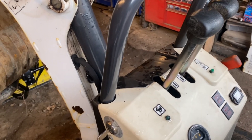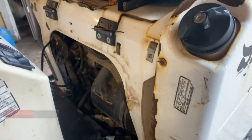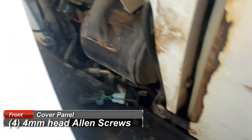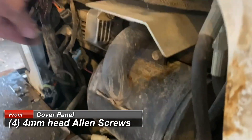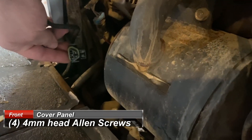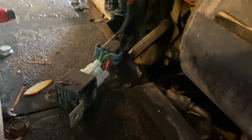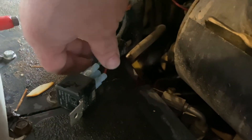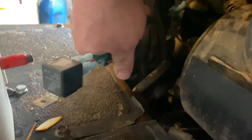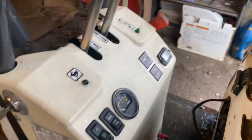The fix in this case was the two-speed module. You find the two-speed module by removing this cover — four-millimeter Allen bolts on the top and bottom of this panel. In this harness you'll find a five-pin plug, although they're only using four pins, and a relay module attached to it. This is a regular relay I've added just for testing purposes — this is not the actual module. When wired up to a regular relay, pressing that yellow button only activates two-speed mode while you hold the button.